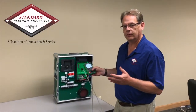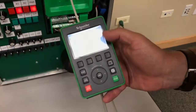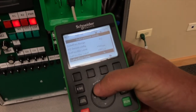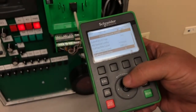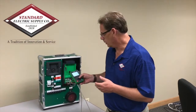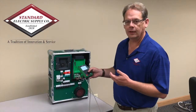As an example, let's take a look at the outlet pressure monitoring. If we pick outlet pressure monitor, you can see that simply to set this up, we just need to know where the outlet pressure monitoring is coming from — it's coming from a sensor, so we probably have a pressure transducer hooked up to the outlet side of the pump. We tell it which analog input it's going to, and we give it an outlet minimum and maximum level. With outlet pressure monitoring, one of the key things you're always looking for is that you don't want your pump to run dry. So if we're monitoring the outlet pressure, we can determine if the water pressure gets below a certain level, then we turn off the pump. Or if it gets too high and we don't want to blow out lines attached to the system, we can monitor the high level. We can also put a slight delay in so that we don't get nuisance trips.